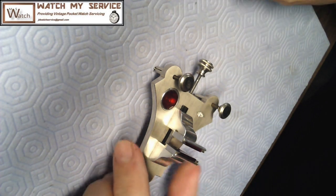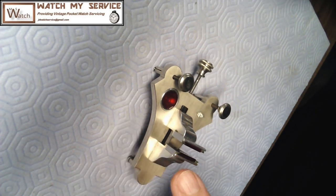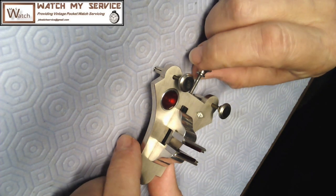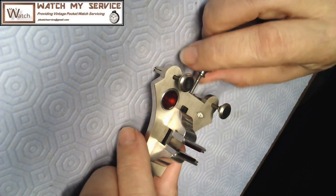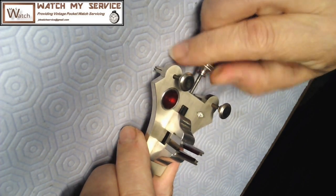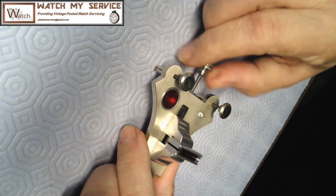So this is a poising device. It's got two ruby guides - or rollers - on either side. These are just sharp pieces of ruby on either side. The first thing you want to make sure for your poising device is that these two pieces of ruby are meeting absolutely horizontally and that they're true on the top. You can just close these up like this and then have a look down the edge to make sure you've got a complete match.